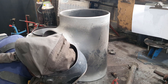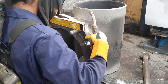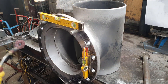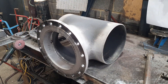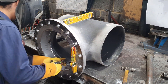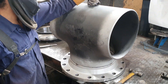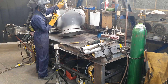First things first, I've got to weld the weld neck onto the tee. I've done my usual two tags at 12 and 6 and I've flipped it 90 degrees. Because of the type of tee I had, it didn't lay flat on the table, so I propped it up underneath and laid a level on top with two bolts spacing it out before leveling off the flange to the tee. Once it's done I flipped it around so I can attach it to my turning handle.